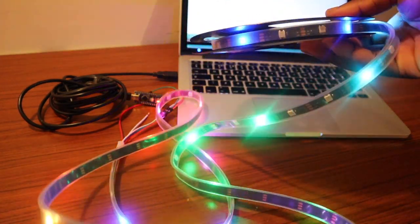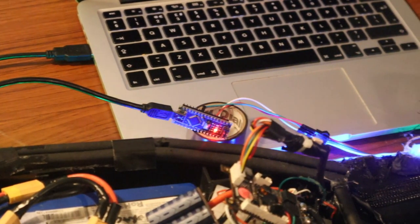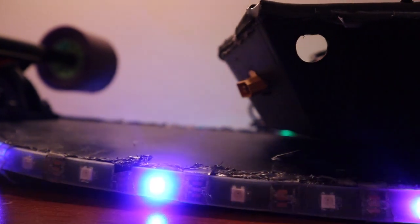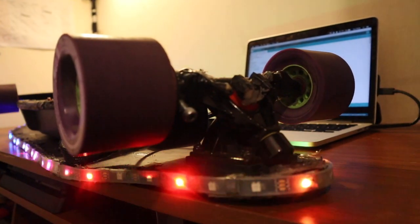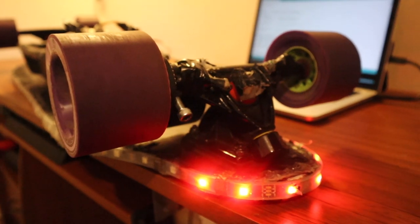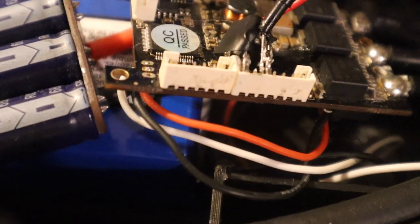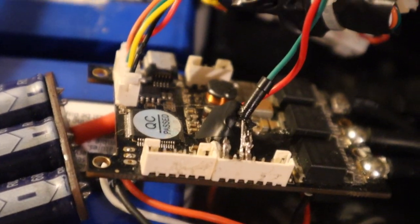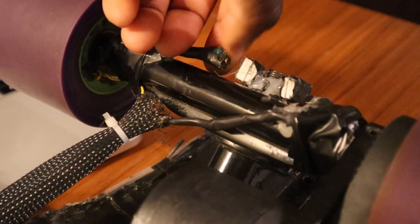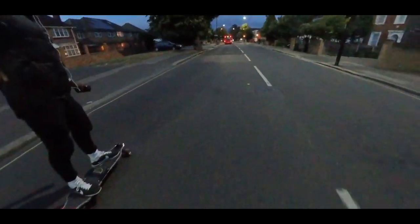The first 60 LED strips are now programmed by our little Nano microprocessor. These LEDs are totally programmable, so you can choose any RGB hue. Cutting off what you need, put the strip around the skateboard and glue it with a hot glue gun. If multiple colors isn't your style, you can program it just for headlights and back lights. With a little bit of electronics, this can be implemented onto the breadboard using the VESC 5V and ground to power the Arduino Nano and the LED strips.